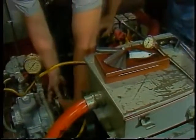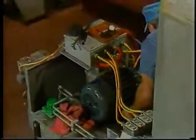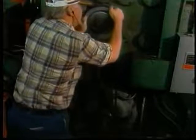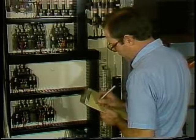Go through the proper alignment procedure to prevent vibration and excessive loads on the motor bearings. Be sure the load puts no end thrust on the motor shaft and that the rotor will operate in the midpoint of its end play. Motors must be bolted down to something solid — both bearing and insulation failure are quicker in motors which vibrate or shake. Use full-size bolts and torque them properly. Drive belts should be properly aligned; keep pulleys and sheaves as close to the motor as possible without interfering with shaft end play. If necessary, reset the overload breakers for the replacement motor, then record the line current and voltage both during startup and after it is running under normal load. Let the motor operate long enough to be sure breakers or overloads will not trip.